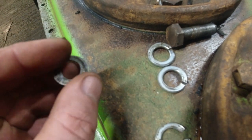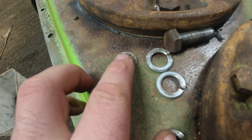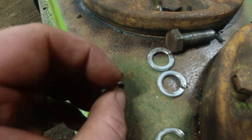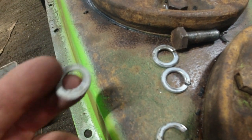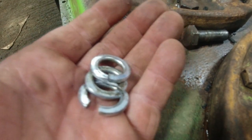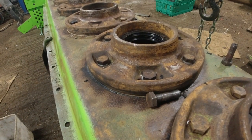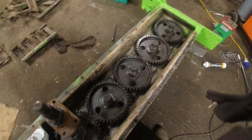The two parts have little ridges on both sides so they grip into the surface and into your bolt. What they do is interlock, so to actually loosen it's going to have to turn that way and actually has to swivel. I watched people with torque sensors on their torque spanners — if that's torqued to 200 newton meters, you actually need more than that to loosen it. They are a brilliant job but they are expensive — working out at maybe €1.20 to €1.30 for every one, and we had a lot of them to put on. That's why I went for the spring washer option first.